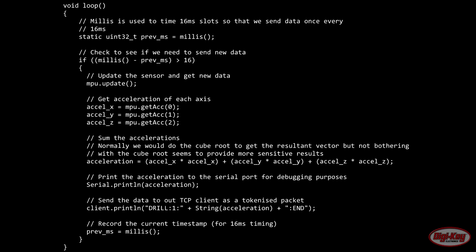The main loop runs every 16 milliseconds using the millis function, and simply reads the MPU9250 to produce an accelerometer reading. When finding the resultant vector of a three-axis system you square each value, sum them together, and then take the square root — though I found better, more sensitive results by skipping the square root step, which made things easier to process.